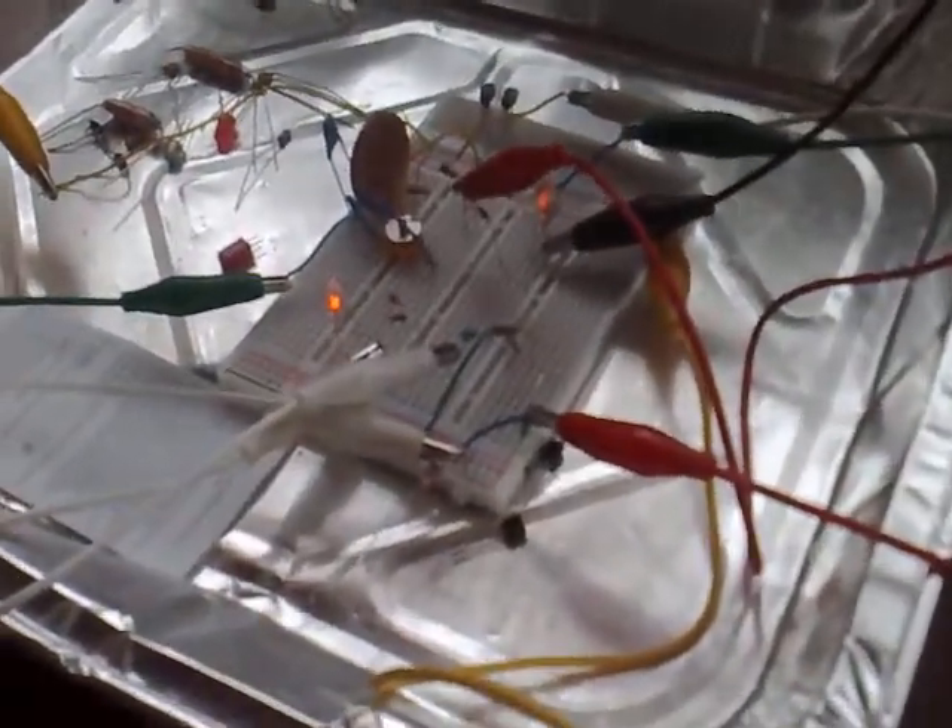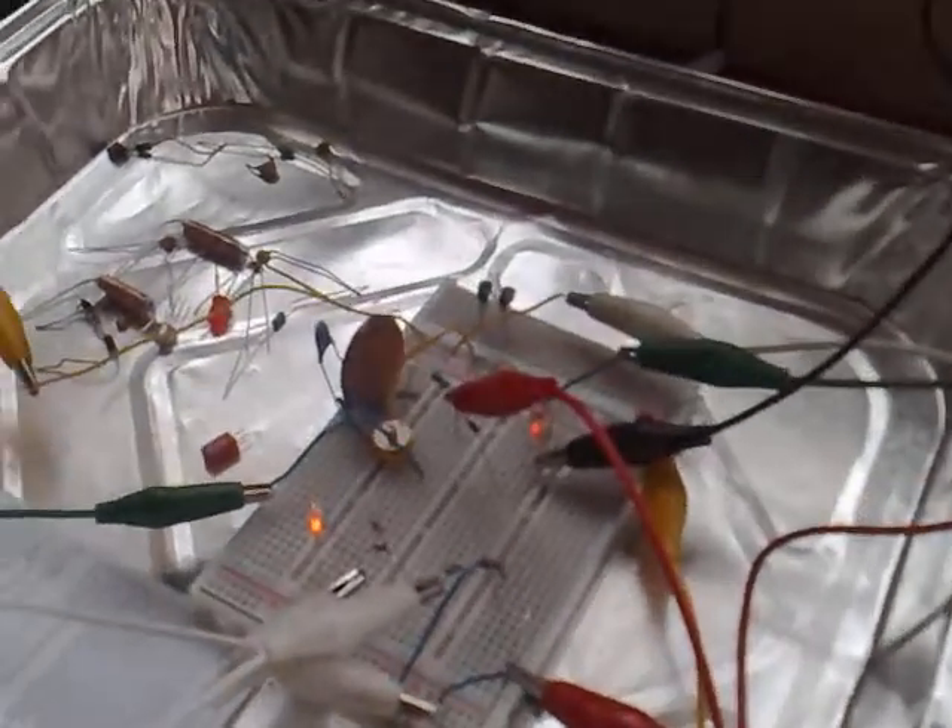This part is the exciter, and this neon has been powered directly from the exciter. This one here is lit wirelessly, and so are these three here. The way I'm doing it is I'm spurring off the 22 microhenry choke and taking that to this aluminium tray, and I have another metal object on the tray but it's insulated.